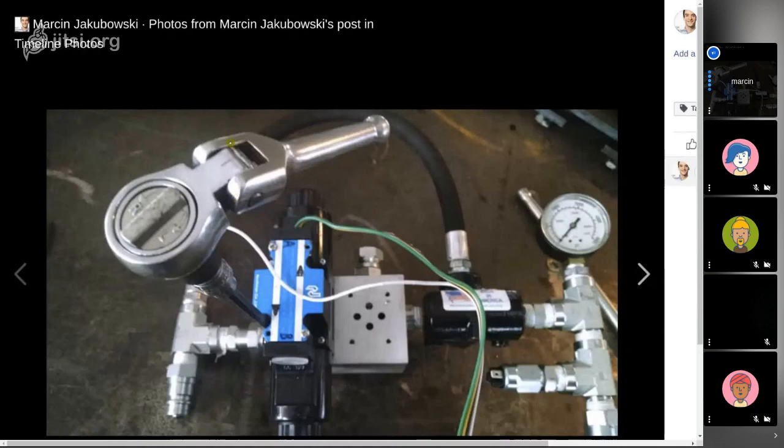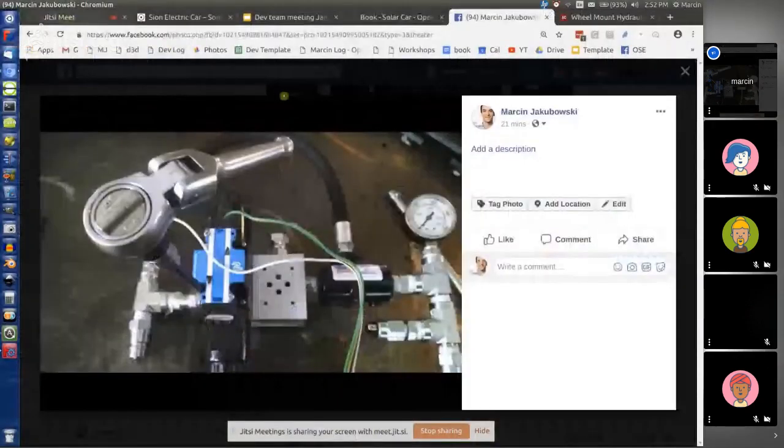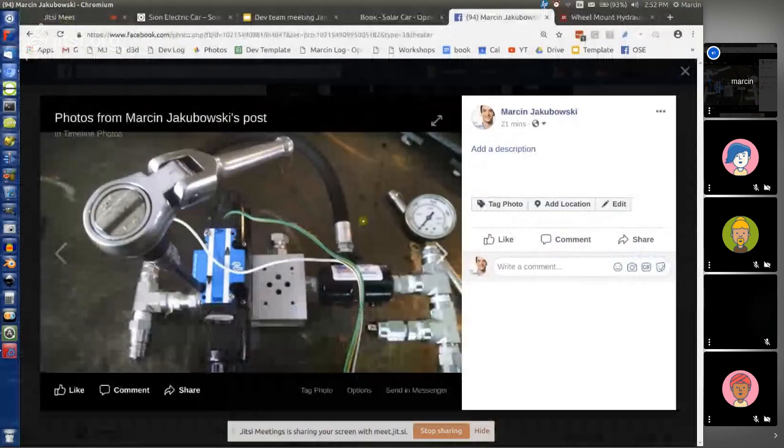But I do want to report on the code. Abe and I are working on a code in the background there. The learnings are that, yes, the routines are working. Just subtle details like the idea that when you measure pressure, you have to debounce the signal. Debounce is a concept where you measure a signal twice just to verify that the reading is correct. That's typically done when you turn things on and off, because you might get weird signals otherwise, because the microprocessor measures things so fast that a point measurement might be a transient event. So you measure that twice.